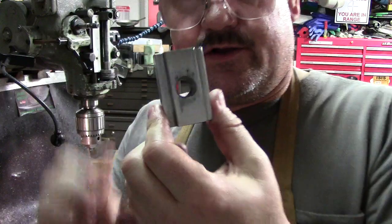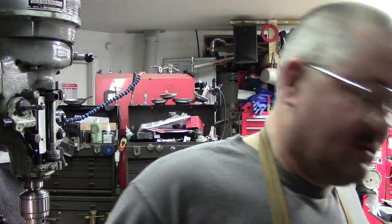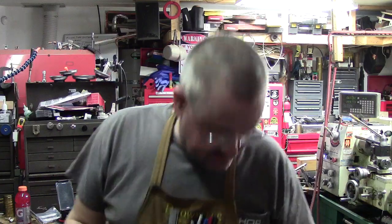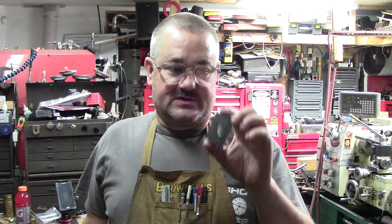So what we're going to do from this point is we'll be putting this in, and we'll heat treat it and everything. Now what I like to do, because anytime you heat treat, dimensions can change depending on what you're doing. Metal, no matter what, I see guys do this or talk about this. Anytime you heat metal, and for those of you that weld out there, you know what I'm talking about. When you put a tack, the other side raises up and vice versa. Same thing when you heat treat.